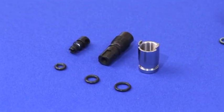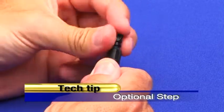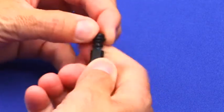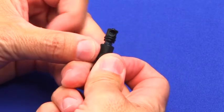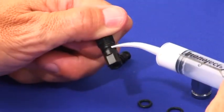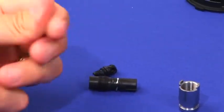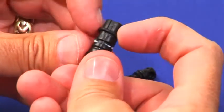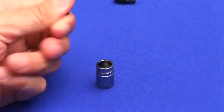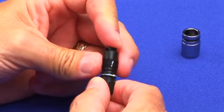Refresh these components with new O-rings. Tech tip: temporarily screw the micro adjust or the adjustment screw into the adjustment shaft — this will give you more control to install the 126 O-ring. Push and spread the 126 O-ring onto the end with the nipple. Once the 126 O-ring is in place, unscrew the micro adjust and proceed. Lubricate the O-ring groove and slide the 293 O-ring down the adjustment shaft into the first true O-ring groove.